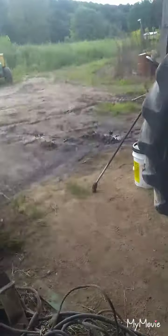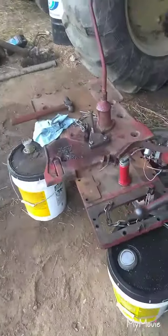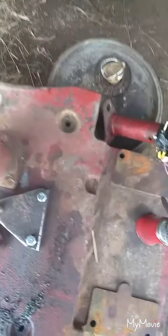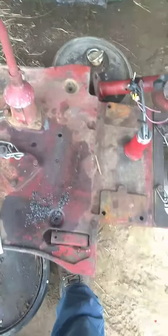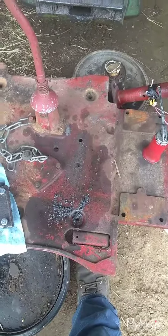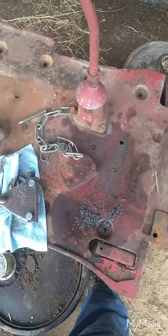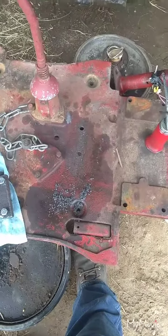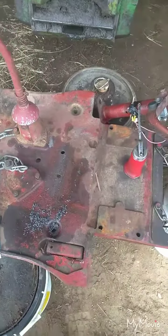And we got the top cover drilled. It's over here behind that 4230. That's the plate that's supposed to go on it. I got some new bolts for that. See the 3 holes there. We're going to clean that up real good, and we're going to use an RTV on it to seal it. And I'm going to seal around the bolts. I'm going to use Loctite to hold the bolts tight in that plate I threaded. And then we're going to clean everything up and throw it back together. I'll get the steering mounted up, and everything should be okay there.